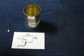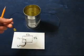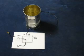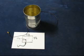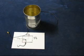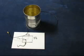So you can buy a router if your computer is not close to where the access point is, because this antenna wire cannot be very long. So use a wireless router, put it near the antenna, and then run the cable down to your computer from the router to get your connection there.